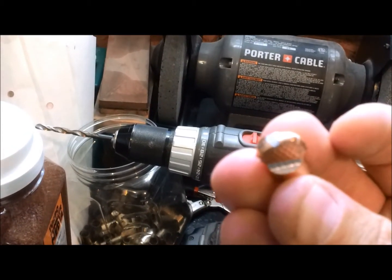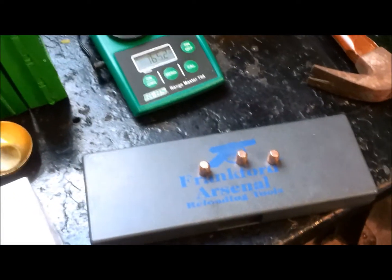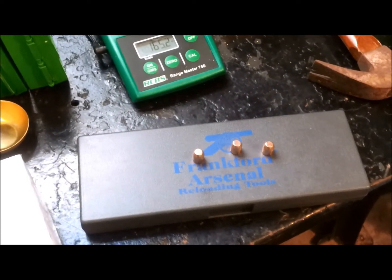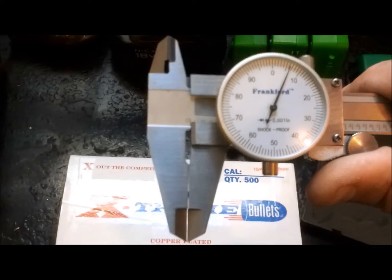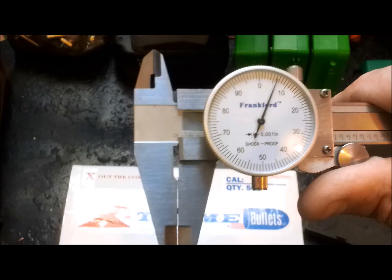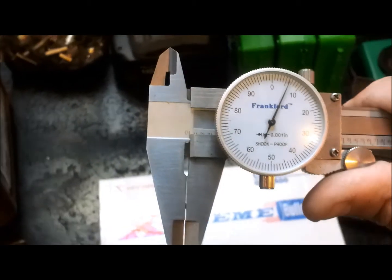Let's see if I can get a good shot of this — there's their plating on the lead. I've already measured the diameter; all five test samples came out to be 0.401 inches. I got a little piece peeled off and the plating looks to be about six thousandths of an inch, which is what they claim.